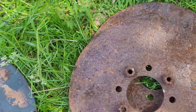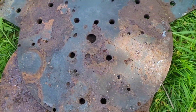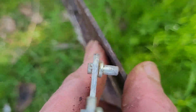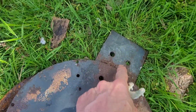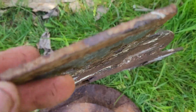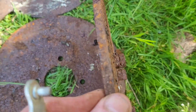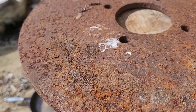Thinking about reusing them sometime. This was a blade hub that I'd made — I didn't fancy using a wooden one — so that's just a 12 inch disc, 3mm, maybe even 2.5mm, and then we've got three metal plates welded on, and they're about 4.5mm to 5mm. These might be 8mm actually — it's got some big old rust.